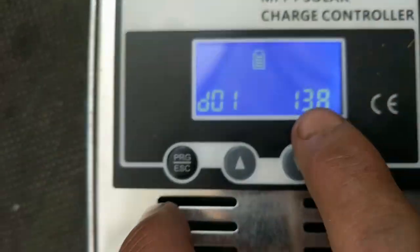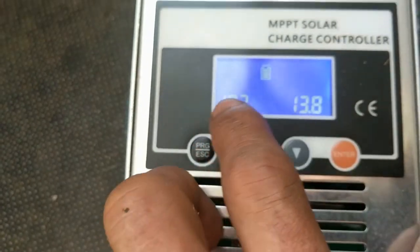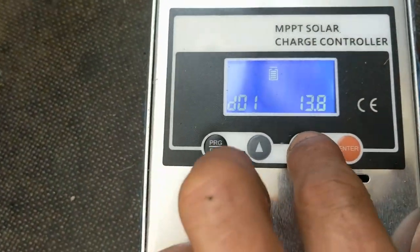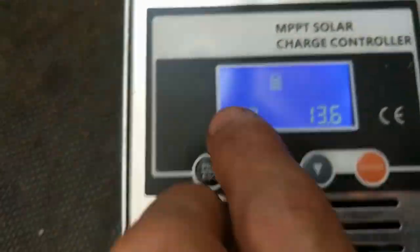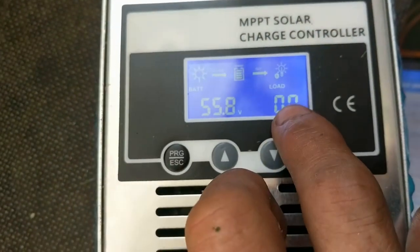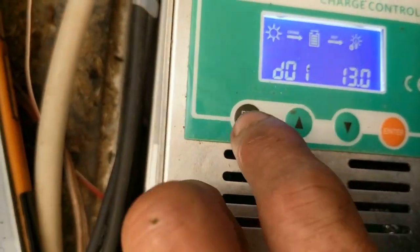This thing will not stop, whereas this other one here is at 13.8 volts. When you set it to the lithium battery type and change it to 13.8 in one section, the second section immediately shows the same value. If I reduce it to 13.6, you also get 13.6 in the second — so this software is a bit better and it seems to work. Whereas this older one is really awful — I already set it down to 13 volts to make it shut down, but it's still making full power.